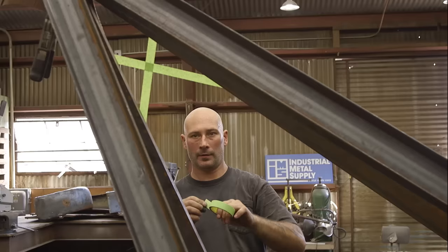It's a stamped steel cap. There's a million ways to make a gas tank — this is one. I could just take the metal, tack weld it, roll it around. Instead of doing it that way, I got this slip roller from Woodward — I'd been wishing for one of these for years. My plan is to make a full tube out of this sheet metal, right around this radius, so I can just open it up, slide it into place around these two end caps, MIG weld it in place, and then TIG weld it so that it's sealed liquid tight. The next step is the inlet and the outlet — I put this little fitting on the bottom and I'm going to cut the filler neck off an old gas tank and put it on here.